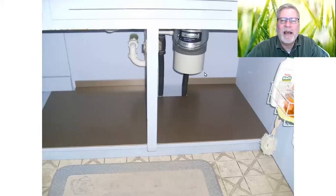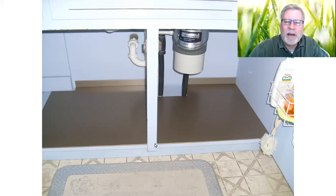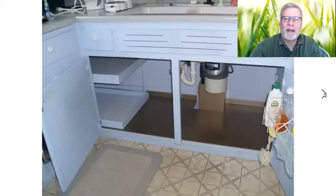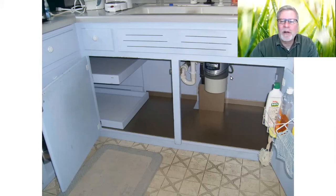There it is in there. I did the ACM on the underside of the cabinets — it's such a clean look. By using the table saw and cutting off the bottom layer of aluminum and most of the plastic, you could hammer the edge of the top piece of aluminum over and get this nice, smooth, rounded edge exposed. That makes wiping off the underside of the cabinets really easy. Also, if we ever developed a small drip or leak underneath the cabinets, it would fall on this aluminum and hopefully we'd see it before it got to be too big or started rotting out the cabinets or even the floor underneath.